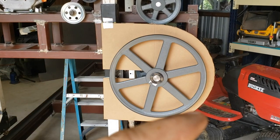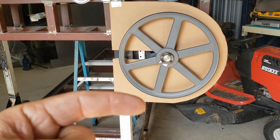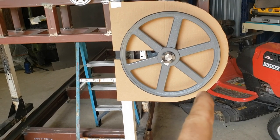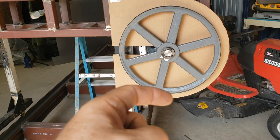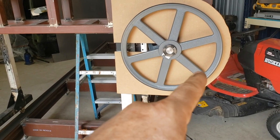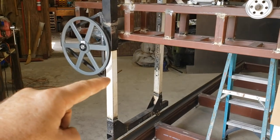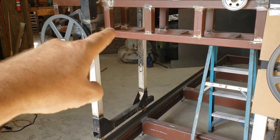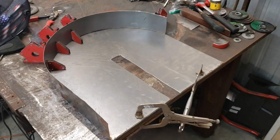On the drive side, because it's cutting in that direction, I'm probably not going to come all the way around — I'll stop down here and leave the bottom completely open so sawdust has somewhere to fall and doesn't build up inside. On the other side we'll go all the way around because there's no reason not to have full protection, and that's the side I'll be pushing the cutter from, so I want plenty of protection.